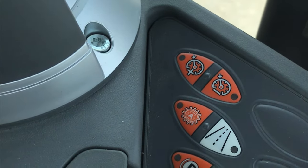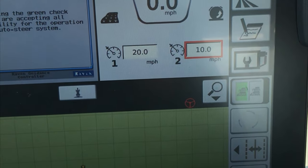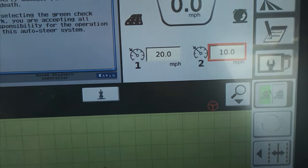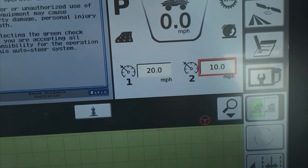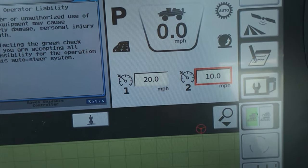The DTM or drivetrain management takes your field conditions and combines that with your engine speed, allowing you to run at a minimum engine speed until you need extra RPMs. This saves a lot of wear and tear on the engine and also offers a lot less fuel consumption.